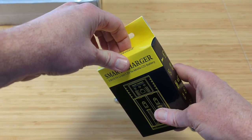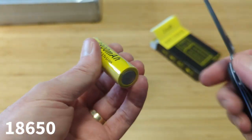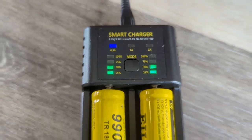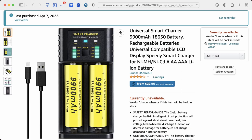Let's take some time to talk about the batteries. As I mentioned, batteries are not included with the DevTerm, and you need a non-standard battery — the 18650 — which looks like an oversized AA battery. They are rechargeable, and the DevTerm includes circuitry to recharge installed batteries. I purchased the Maxion Universal Smart Charger with 9900 milliamp-hour 18650 rechargeable batteries. That's the real listing on Amazon — you're not going to remember any of that, so go to the companion blog post, link in the video description below.